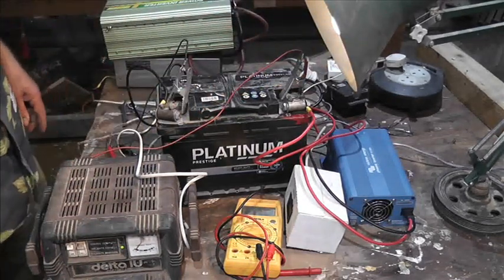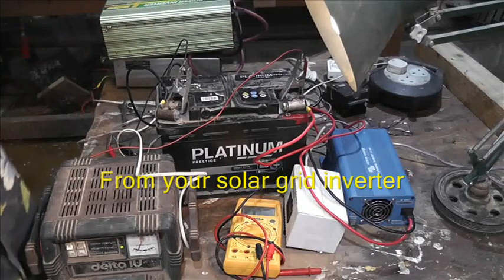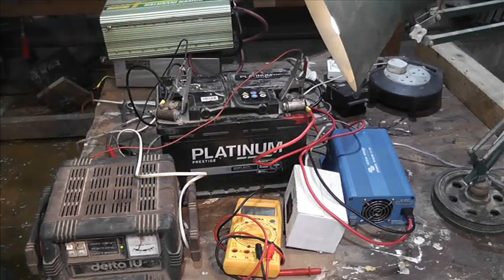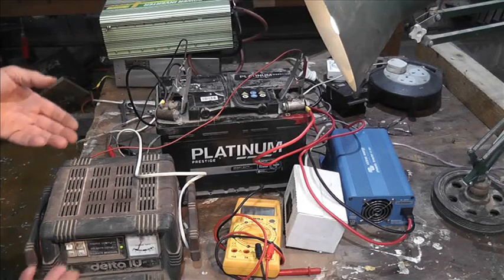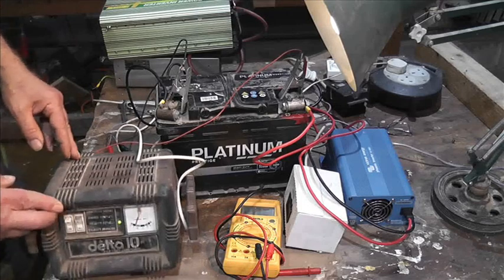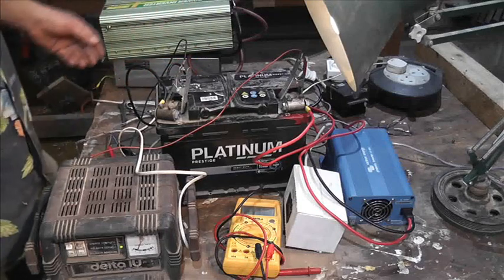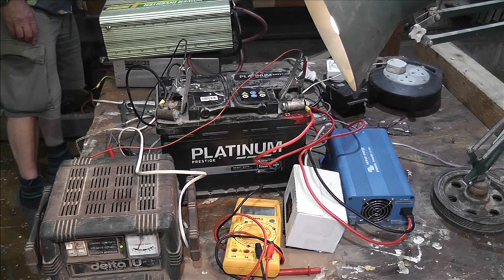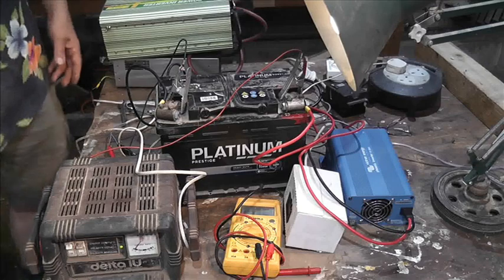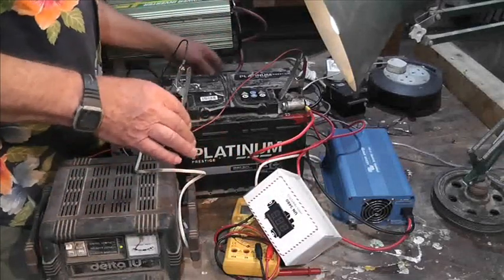Maybe that's just your television and it only runs in the evening. During the day the battery is being charged; the television, the light, the fridge, or whatever can run off the inverter - it's all relative to the size of the equipment. The battery is charging at about 2 amps, the inverter is running the light. When the charger switches off, the inverter keeps running - that way you can save your solar-generated electricity during the day and use it at night.